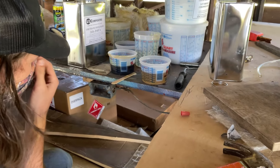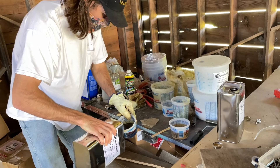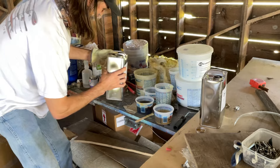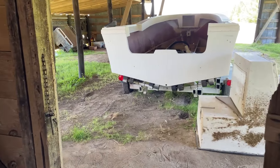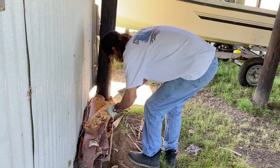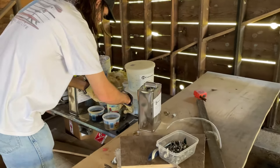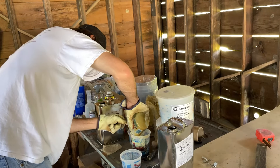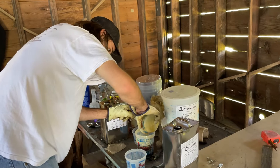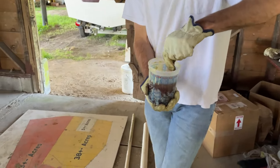We're at about ten ounces. He got a little excited — it's okay. Since it's already hot and reacting, I'll clean that stuff out so we can get fresh material. After doing it, I realized I have a little more time than recommended. It said 25-second stir time and 45-second pour time. It took quite a while to actually expand and turn into foam from liquid form, so we definitely have longer to stir and make sure it's well mixed.